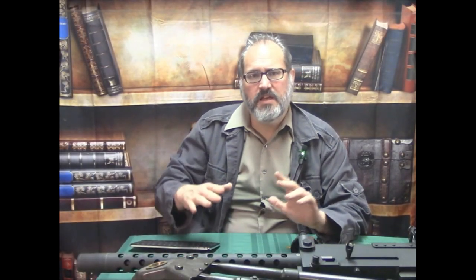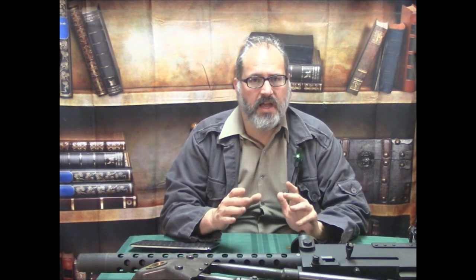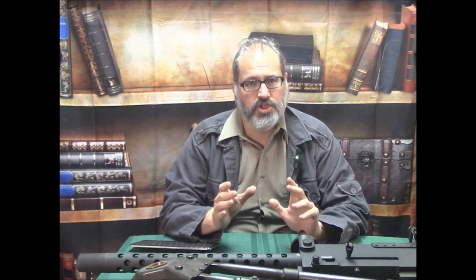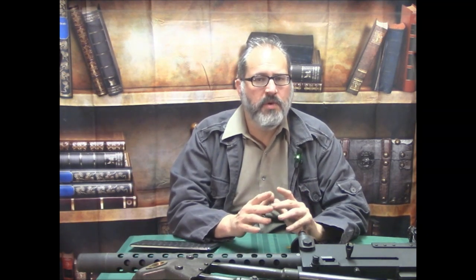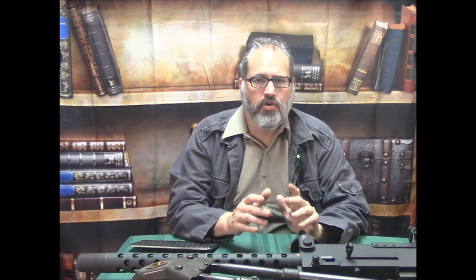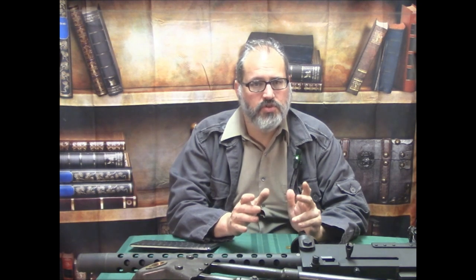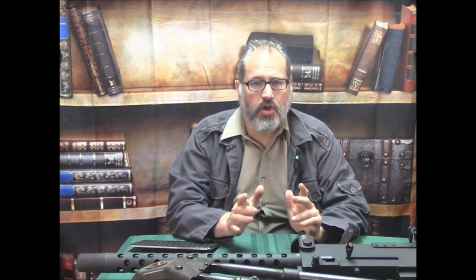The M1919 is a closed bolt design, meaning the gun uses a firing pin and striker in the bolt, which fires the gun when the bolt is closed and locked. As a recoil-operated gun, the entire barrel moves back in battery when it fires. Because they fire from the closed bolt, heat is a particular issue with Browning machine guns. Excessive heat in the barrel can cause a cook-off, when ambient heat from the barrel causes the powder in the chambered round to ignite, firing the gun without pulling the trigger, potentially even causing runaway full-auto fire.